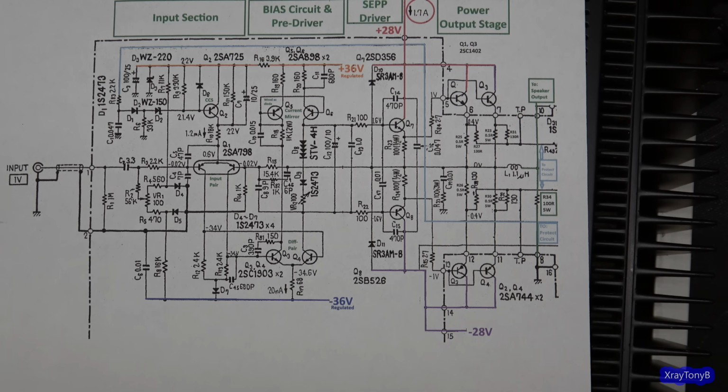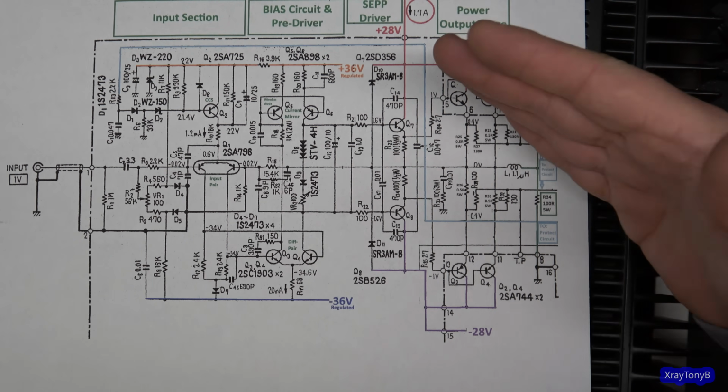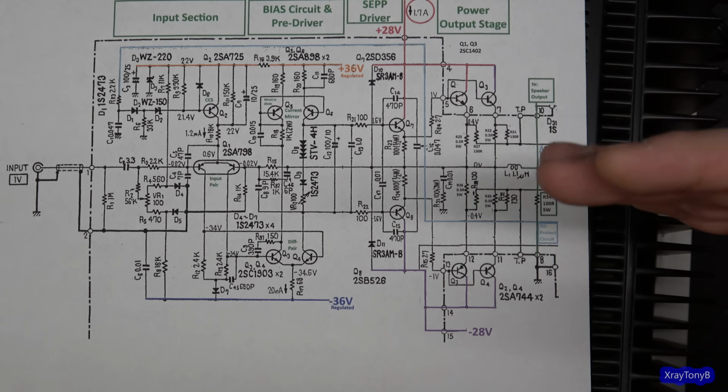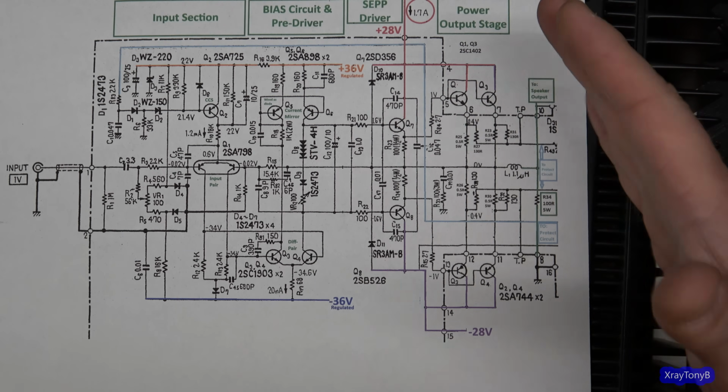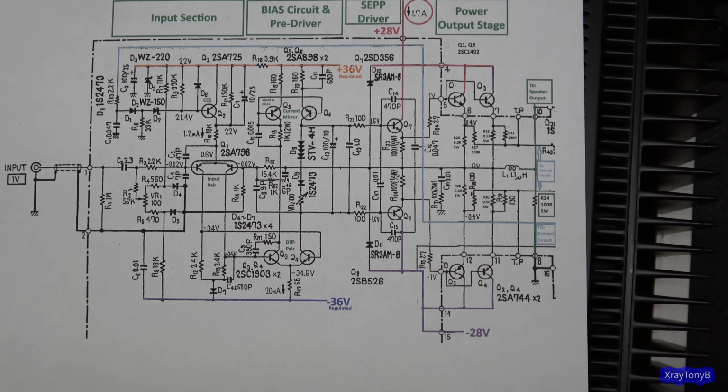It's super inefficient. You're wasting so much power. As we did our little experiment, you notice this thing is drawing full current from the mains at idle, and it never changes. No matter how loud or quiet you turn the volume, it pretty much keeps the same current draw out of the wall all the time at your mains voltage. So real interesting how this works.